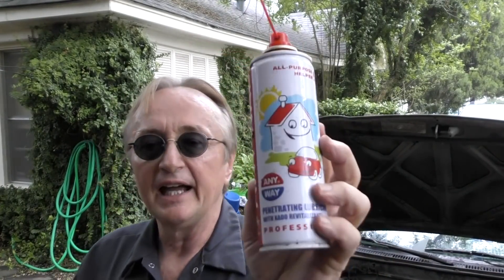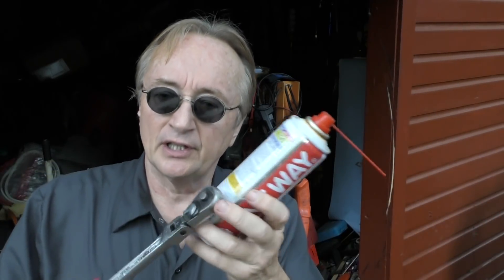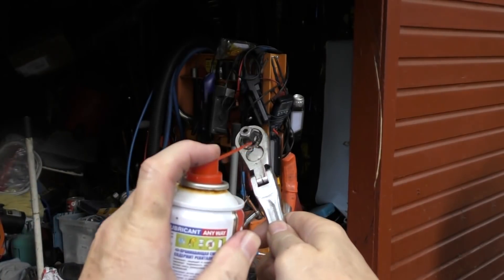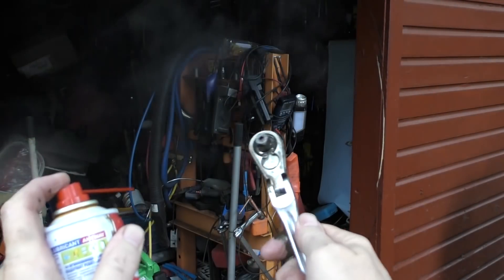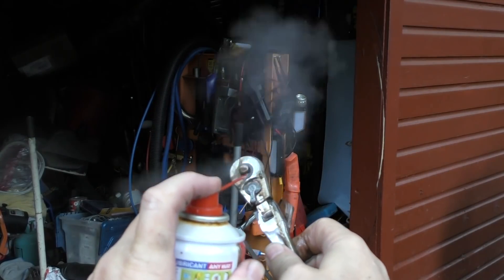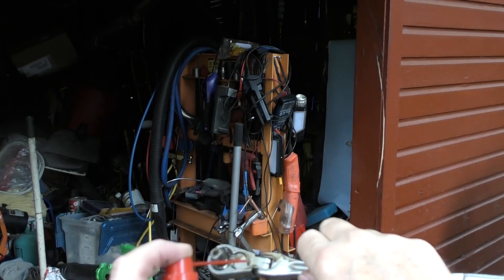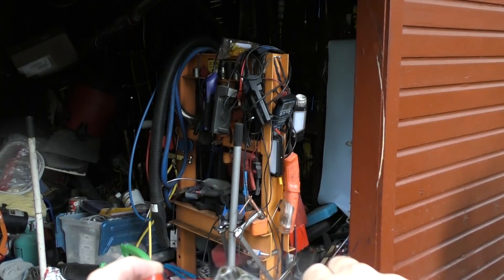I use all kinds of different lubricants, but there's a new one called Anyway by this company Zato, and I've been trying it out and it seems to work pretty good. It lubricates parts to prevent friction, especially in a ratchet head, and it also displaces moisture. So on this 30-year-old ratchet, you want to spray the head — look at all the dirt and corrosion that's coming out. You spray the other side, the hinge, and all the parts that move — look at all the dirt and corrosion coming out.